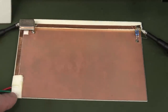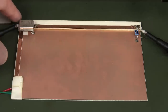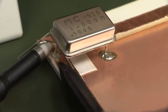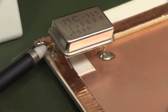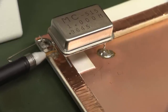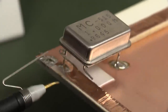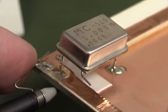5 volts DC comes in here. The green is the ground, going to the big copper ground plane. The plus 5 volts goes along this copper tape to the top pin of a 1 MHz crystal oscillator. The ground pin is soldered directly to the ground plane, the positive pin to the input tape. The output connects to this copper tape up here. I'm using a proper low-inductance probing solution with my 1 GHz bandwidth Tektronix probes — a tiny loop of wire connecting the probe directly in, with a very short ground to the ground plane, giving excellent high signal-integrity probing.